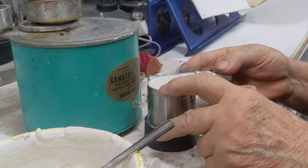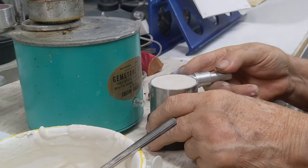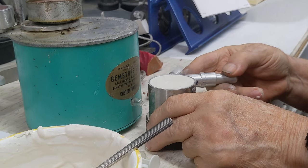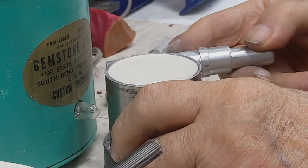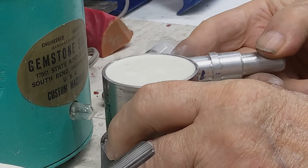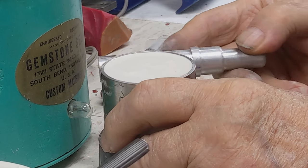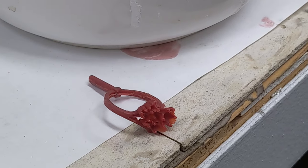There's also a liquid you can get — I haven't found it yet, but there's a liquid spray called a super wetting agent. You put it on there and it'll make the investment stick to it quicker with less bubbles. I like getting as many bubbles as possible out, because sometimes they're annoying when you're trying to finish the ring in a bad spot. Or if you get one caught on the little prongs, then it's just a solid mess — a monster to get rid of.